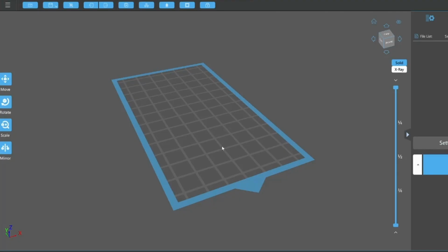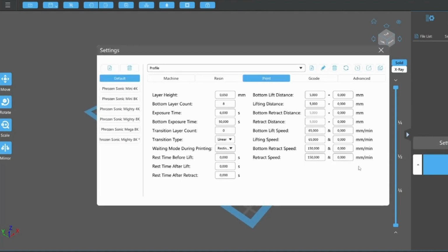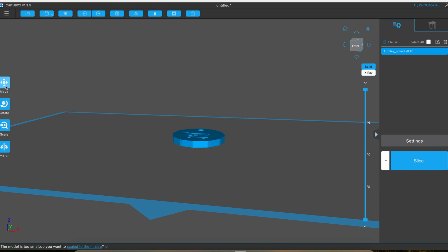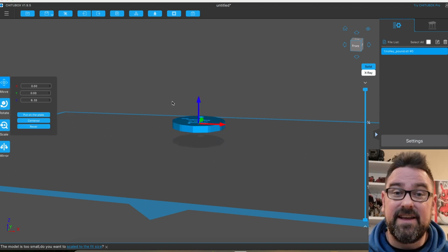First, things that are obvious now, but I just didn't realise. Just use Chitubox. It's free, easy to use, and does everything you need. Don't print things directly on the bed. The first number of layers is about making things stick and shouldn't be part of your model that you want to print. Raise things up.